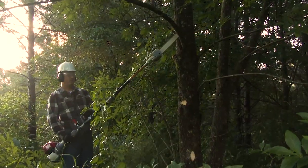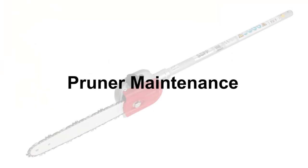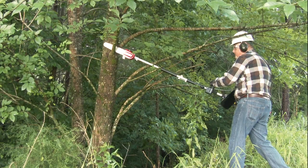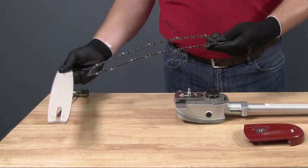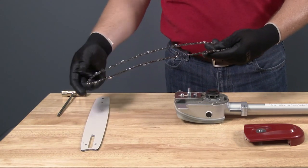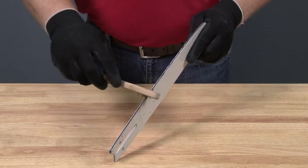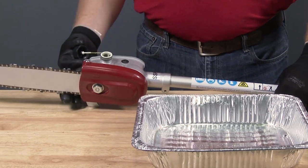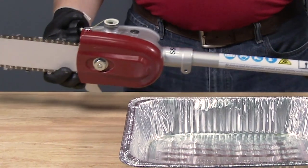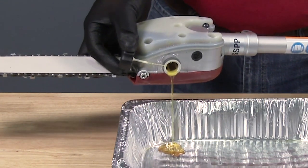For safe cutting of branches and tree limbs, it's best to consult the owner's manual for tips. With a few simple maintenance steps, your Versatach pole pruner can be trouble-free for years to come. Occasionally, the guide bar will need to be cleaned and greased. To clean the guide bar, remove the chain, then use a stiff bristle brush to clean any dirt and debris from the chain groove. If storing your Versatach pole pruner for extended periods of time, drain the chain oil from the reservoir into an appropriate container so that it doesn't leak out.